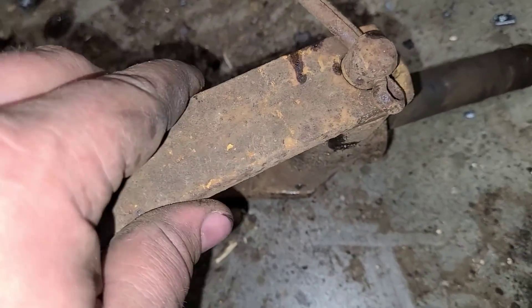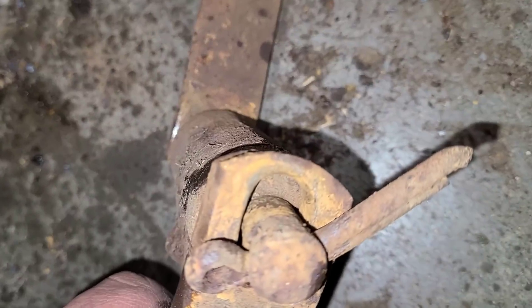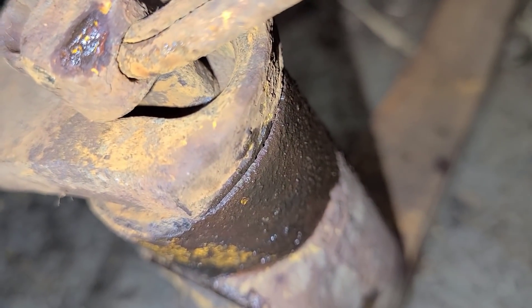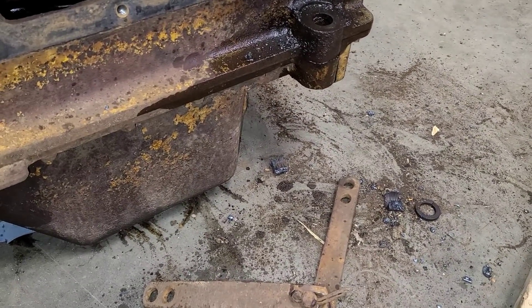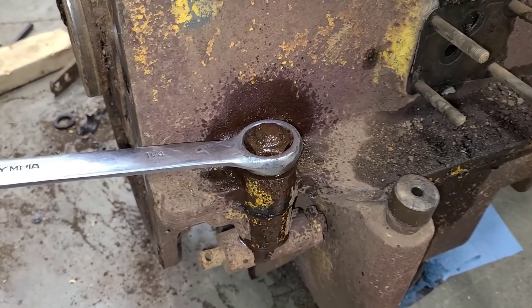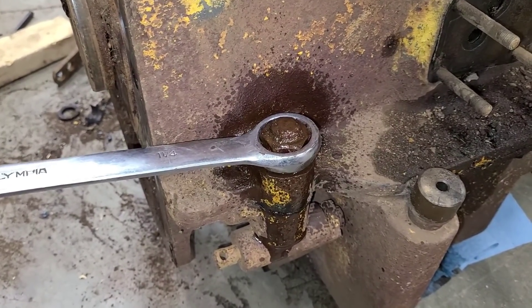Here's a better look at those pins that are worn out. They had almost worn all the way through the flat bar and made just one nasty groove in that pin — almost wore all the way through the pin. So I have another side to do. Hopefully I don't fight this one as hard as this side, and then we will be pulling the oil pan off. On the other side it was an inch and 5/16ths nut, but this side is an inch and a quarter — I don't know why the discrepancy between the two different sizes.